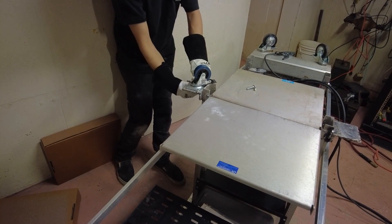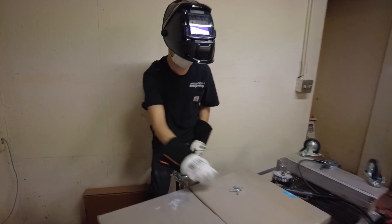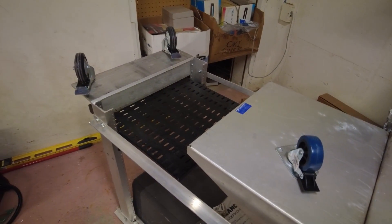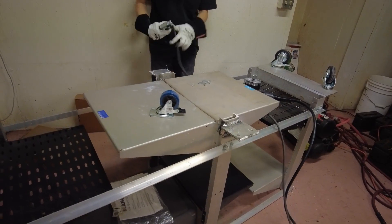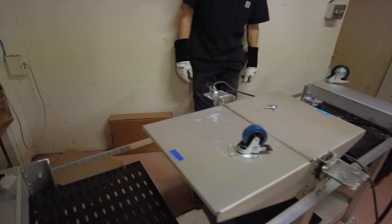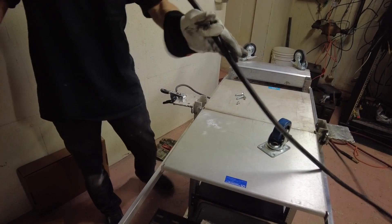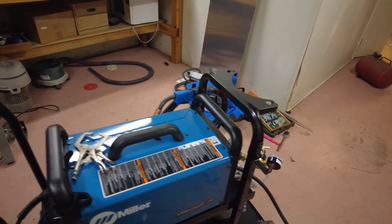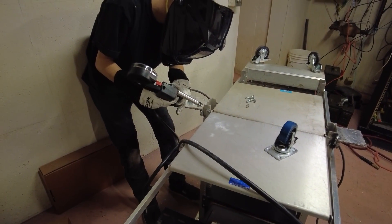We discovered we needed a center support, so we're adding wheels in the center. This is my son — he's helping me weld. He made a comment that I should move these wheels to the inside and it would be more stable, because we're noticing we're getting a lot of flex with the aluminum. I might have to reinforce this support here, but I want to avoid using steel to keep the weight down. He's going to weld up the next wheel — we tacked it on top. Took us a while to get the settings right on the welder. It wasn't working by the book; I think it's because those are dissimilar aluminum — one probably melts hotter than the other.